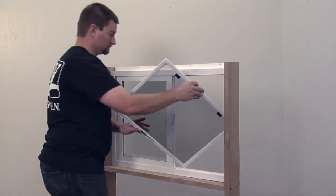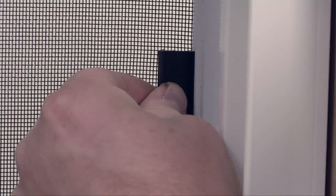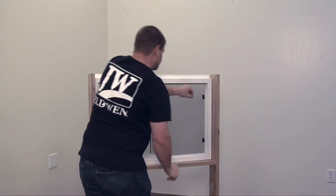To replace the screen, pass it through the window opening, then seat the collapsible springs into the groove around the window. Align the pull tab side of the screen so the screen is seated into the groove. Release the pull tabs, locking the screen into place.